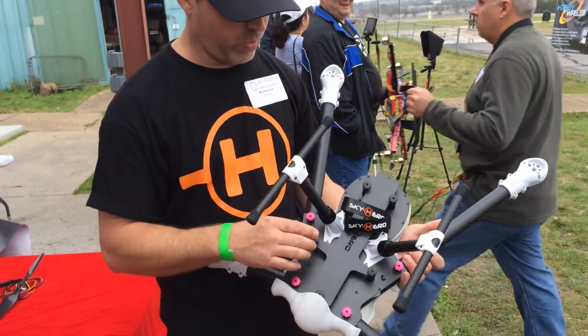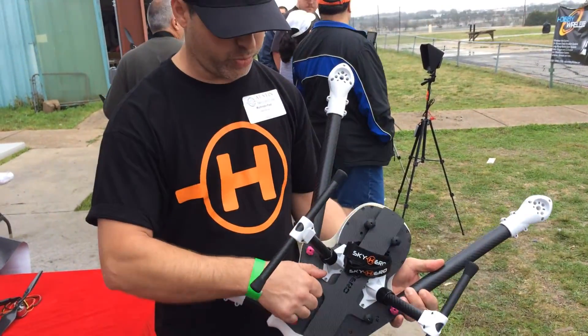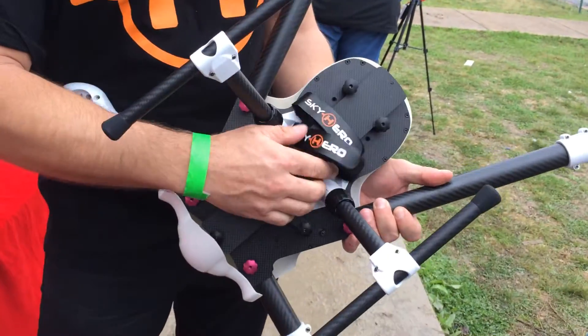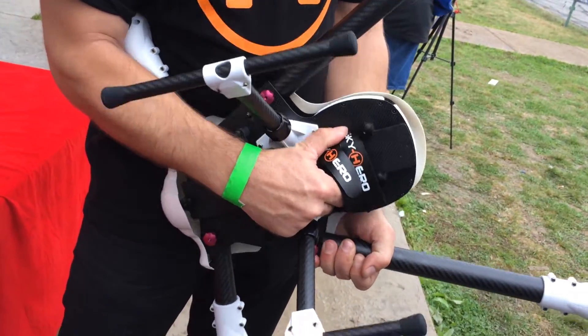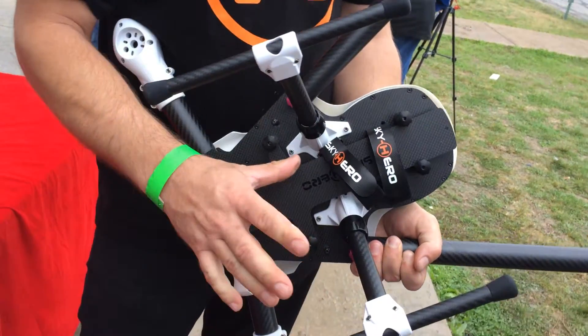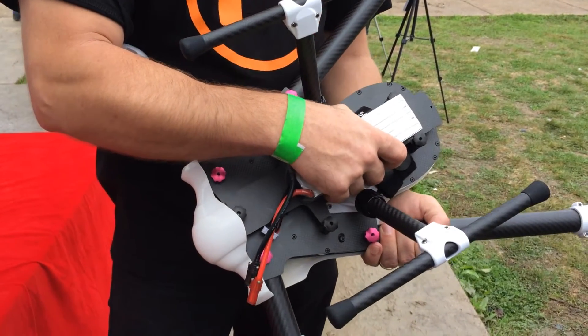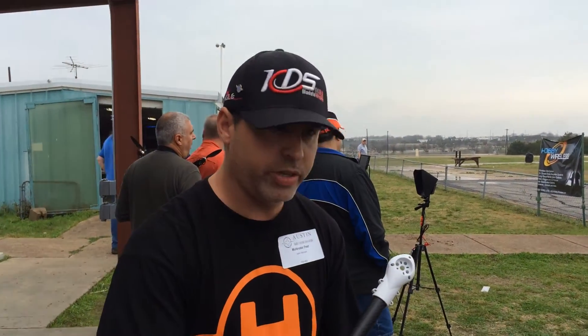For isolation on your camera mount, we have what we call an inertia plate, which mounts with these thumb screws really easily. It's easily removable and it's got rubber isolation so that it's very, very absorbent. We use a 6S battery strapped to this plate, so once you strap this mass to that plate, it really, really dampens out any vibration — no jelly, no wobble in your video.